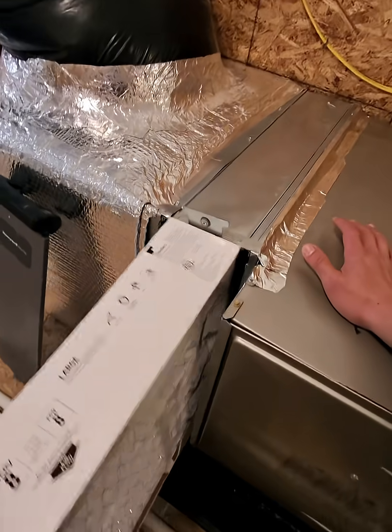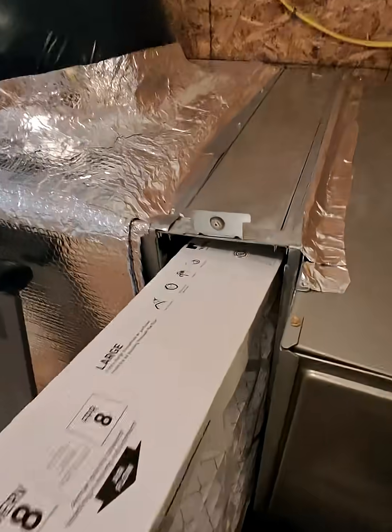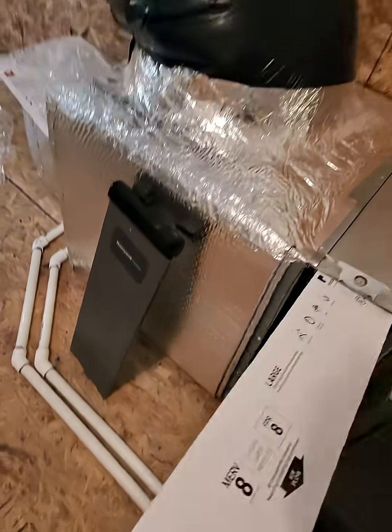I would always say make sure to be looking at the filter more than ever during renovations. I've been in homes where we did recent installations, they were doing a new bathroom, and she told me she changed it out in the last two weeks — and it already resulted in a frozen coil. Let me turn off the system so I don't have that airflow going against me.